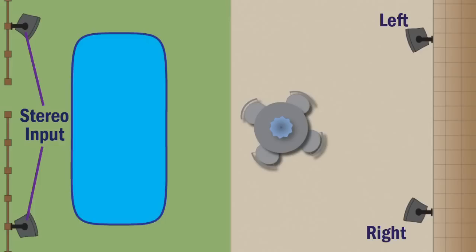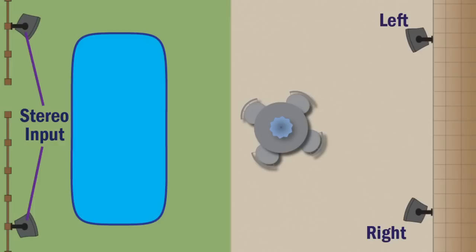Depending on your space, you might opt for traditional speakers, stereo input speakers, or a mix of both. To get good stereo sound with traditional speakers, alternate left and right channels. For more info on choosing speakers, see our video at crutchfield.com/choose-outdoor.